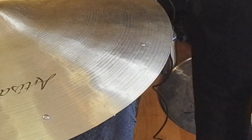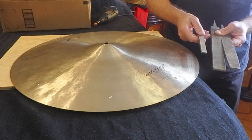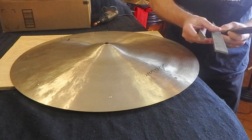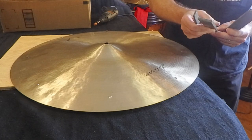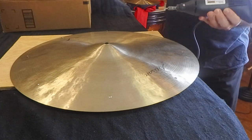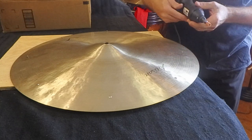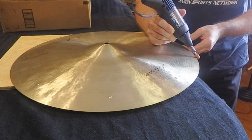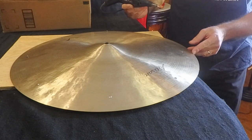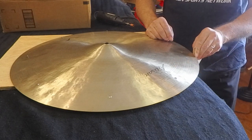What I have here are a bunch of files that I use. I'll start with a coarse one and work all the way to a very fine file — that's what I suggest you do too. This is very fine, this is more coarse, and this is the most coarse — I call it the brutal file, which will pretty much take anything out. You've got to be real careful with these. If needed, I'll use this Dremel tool here with a fine stone on it, normally used for polishing. Make sure you use goggles. Finally, you can use some really fine sandpaper — I'm using 400 grit, actually wood sandpaper.